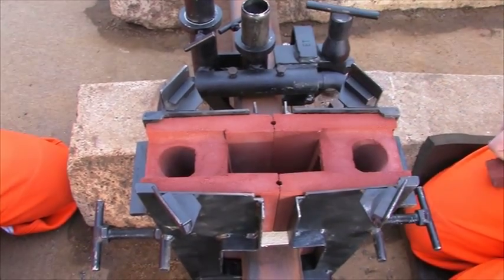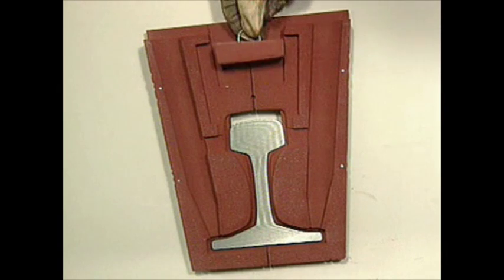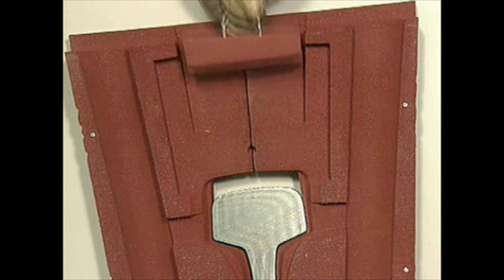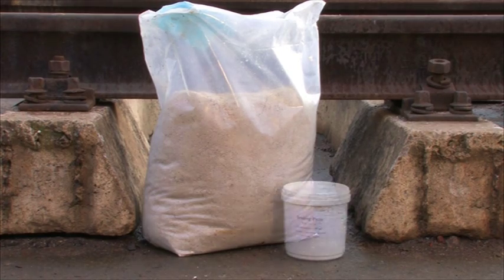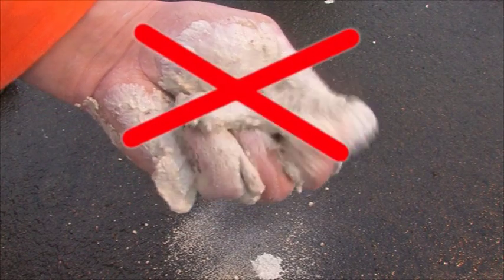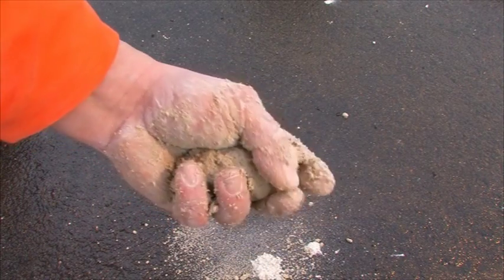When welded in curves, the rails are canted. The steel shall pour equably over both plug ends into the moulds. Thus the top surface of the mould plug must be filed to ensure that it is horizontal when fitted into the mould. For sealing, the moulds optionally either luting sand or luting paste are available. Luting sand shall not be too dry or too moist. It should be well kneadable.